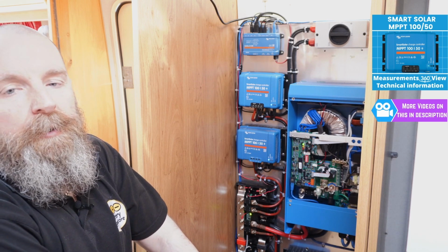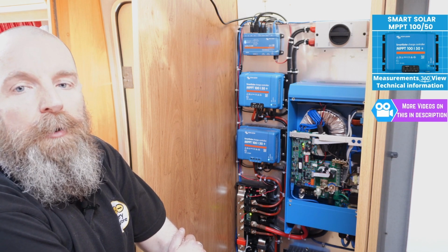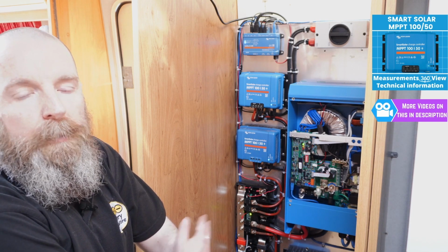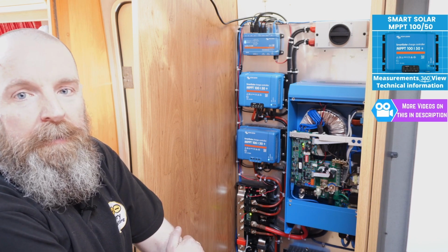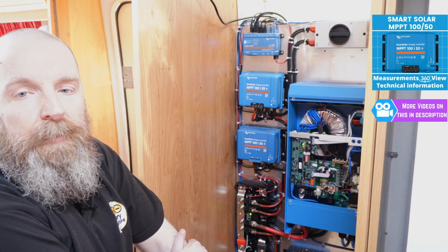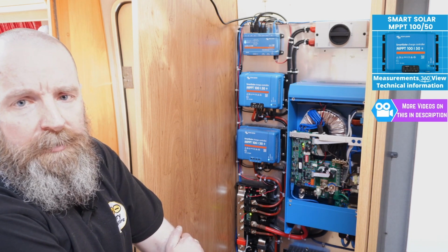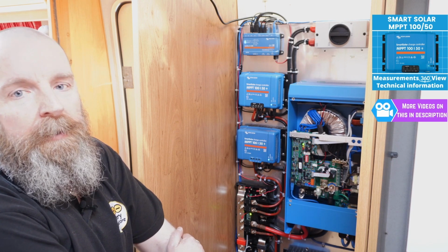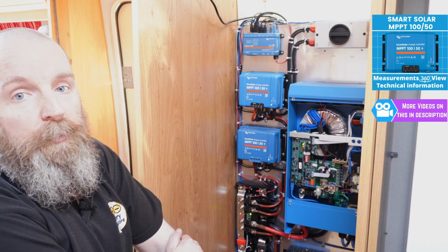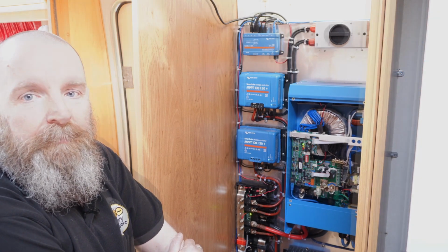When you first turn on the solar controller, make sure that there's no solar panels connected. You always turn on with the battery bank first, program the unit, and then finally commission by connecting the solar array. Again, in another video I'll show you how to do the firmware update. Normally you find with the solar controllers the firmware update is mandatory when you first power up, but as I say, I'll show you that in the next video.